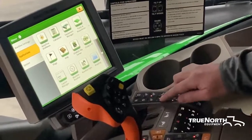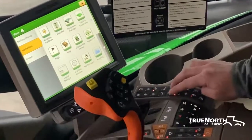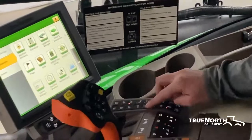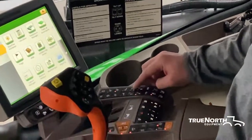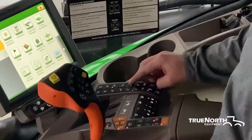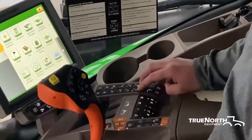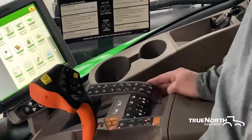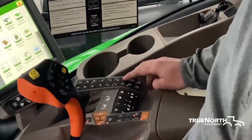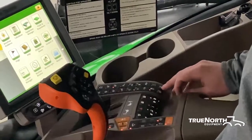We have your fence row nozzles left and right. These four buttons are tied into your exact apply system and your different ways you can spray. If you have the top one on, you are engaging your exact apply pulsing. Moving over, we have your auto — with auto, it's going to spray conventional and automatically switch between solenoid A and solenoid B. Moving down, you can run just off of nozzle A and nozzle B. If you are running A plus B, both of these lights will be on. Moving down, we got your video — if you do have cameras hooked up, you are able to have two video inputs right here. Below that is just another three customizable settings that you can select.